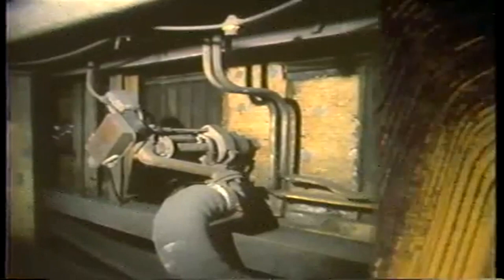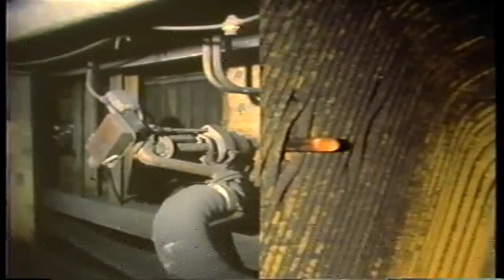Other problems besides erosion may crop up in the soot blowers. Soot blowers enter the water walls through openings that should be checked when inspecting the water wall. Look for damage to exposed refractory in and around the openings. Make sure the openings are clear of ash and slag. Also, check to make certain that all the soot blowers fully withdraw. Heat in the furnace can damage the soot blower lance.